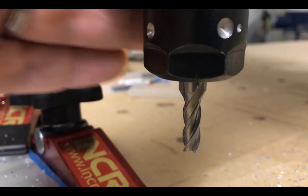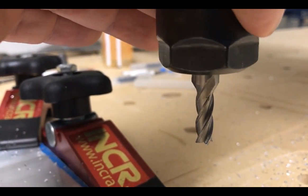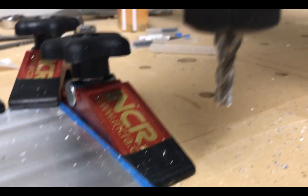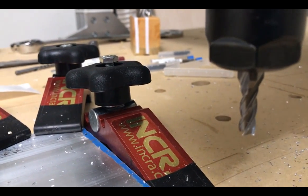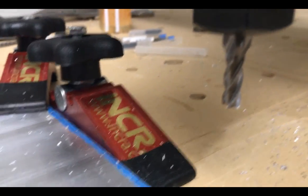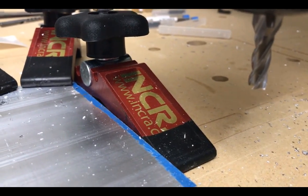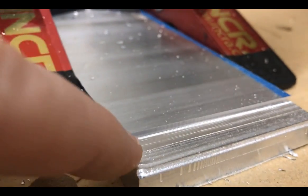Just wanted to show what that quarter end mill result is, this is the end mill that seems to be just kicking butt. It's a four flute, high speed steel. You're not supposed to use four flute, and high speed steel is kind of, nobody uses that anymore, everybody uses carbide, but I'm pretty impressed by it. And a whole kit of them was like $13. So I expect them not to last long, but it's good learning material. But look at that. Okay, it did that whole cut.